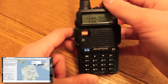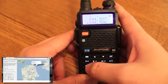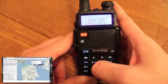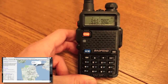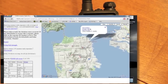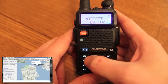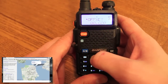I'll turn this radio on and tune to 442.075. I'll give it a second to see if anybody's there. It doesn't sound like it. So we'll go ahead and put in the other settings we need. There's that plus sign, so we need to set this thing up for a positive offset, which is menu setting 26 on here. Hit menu, then scroll around looking for offset.